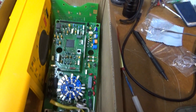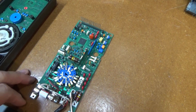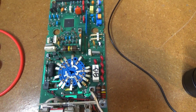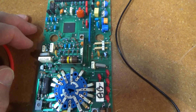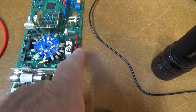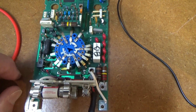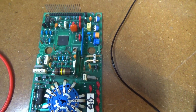I do have a kind of a parts machine over here. I'll dig out the schematic and do some measurements to see if I can figure out what's wrong with this guy and why it's not reading AC voltages. I haven't figured out yet what's going on with the AC side. I've tried measuring some of the components the manual suggested could cause AC to be inaccurate, but all of those seem to be good so far. All the input protection components are good — these resistors, these MOVs, the diode bridge, the input resistor. I need to really isolate on the things that affect AC.